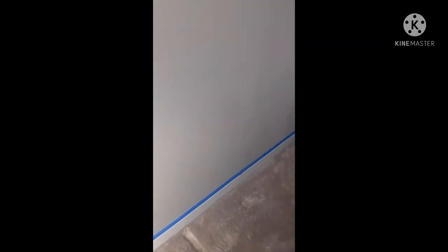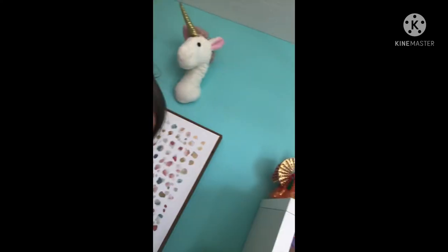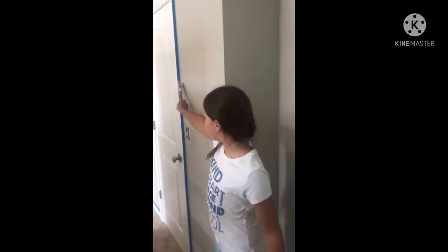Only a little bit because we're painting this part of the top of the wall white here, and then along the side of the door. We are painting the top of the walls white — not the top of the ceiling — so we don't have to tape where the walls are. Now I'm going to cut in with this paint brush along the tape at the bottom and along the door, so we can use a roller afterwards.